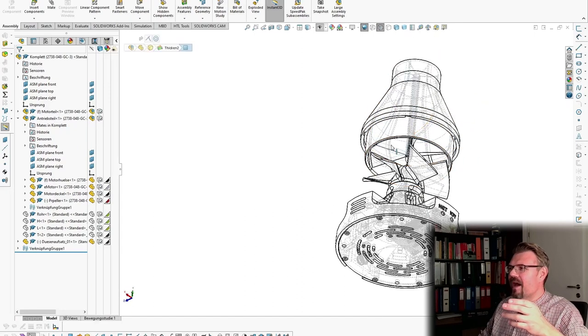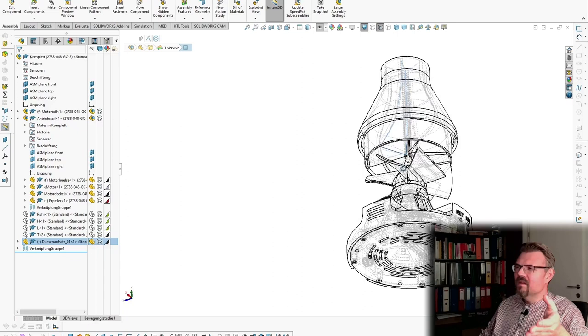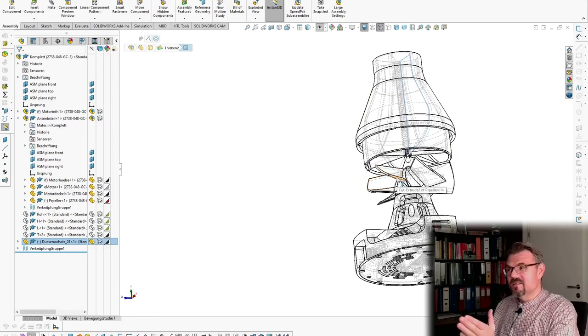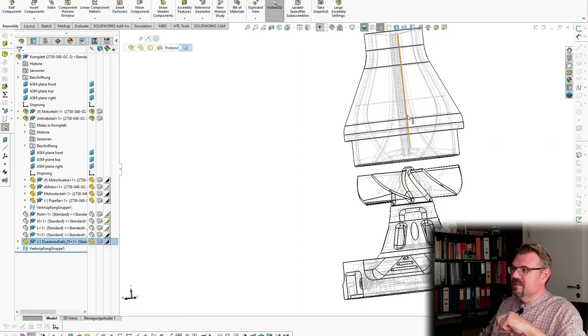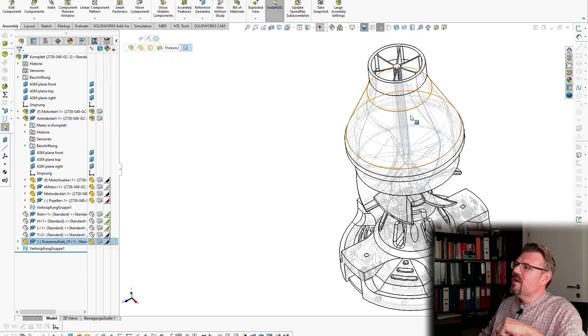These things are called guide vanes. You can find them in every pump and so on. It's always the same. Yeah, in a turbine it would work the other way. The water would rush in here. Yeah, and we would then accelerate this in radial direction and use the turbine to break this. Yeah? Looking pretty much the same, yeah, but with different flow. And now we accelerate this in this direction. Yeah, and since we have now a spin, we will slow the spin down and lead the spin up here.